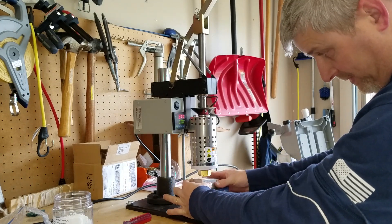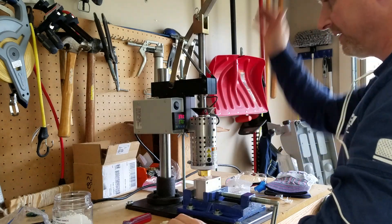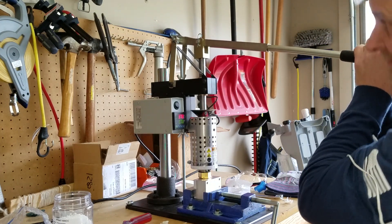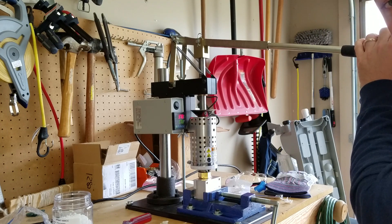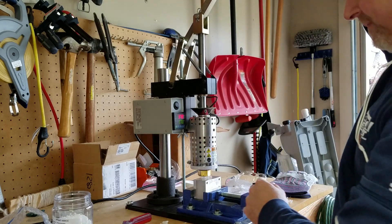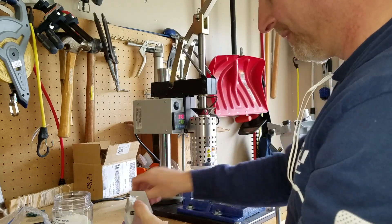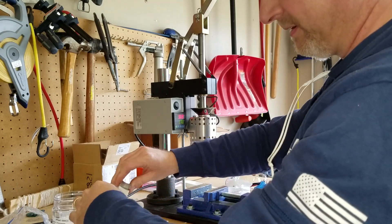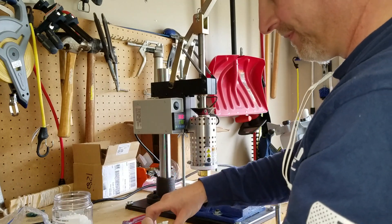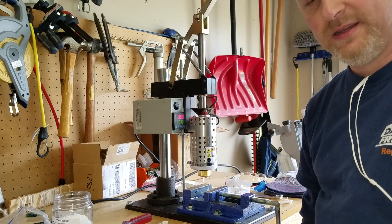It's only taking me like 10 minutes or so to get this to work right. There's enough plastic in the hopper up here for two shots in my particular mold, which is about a quarter ounce of plastic. I don't know what that is in grams, but it's pretty simple and straightforward — pumping out a piece every 20 to 30 seconds if you want to be quick about it. And that is my LNS Technologies 150A plastic injection molding machine.